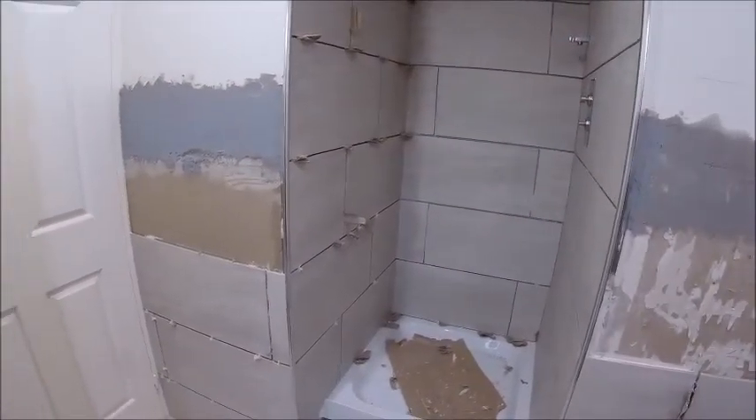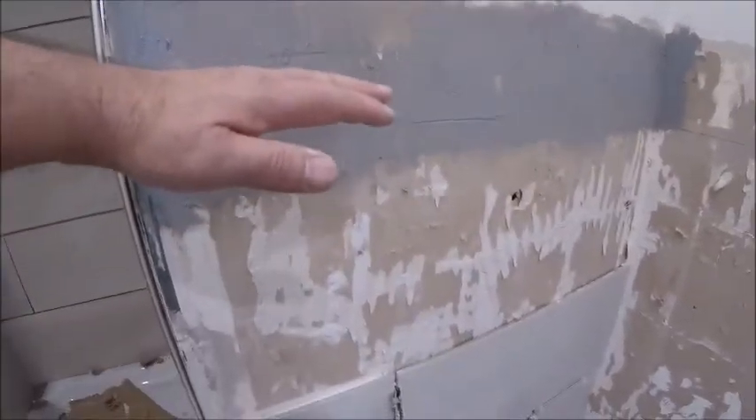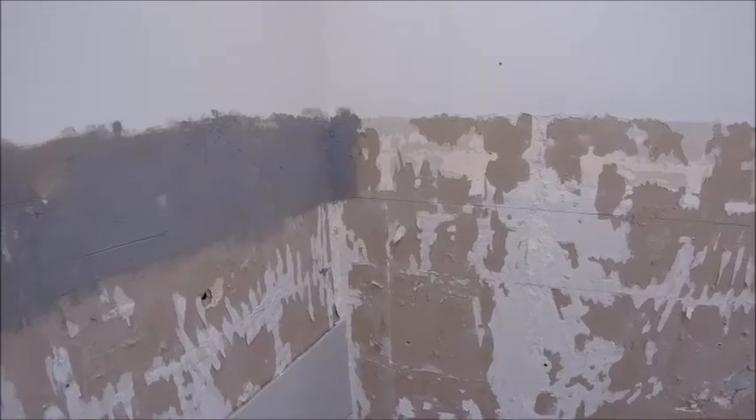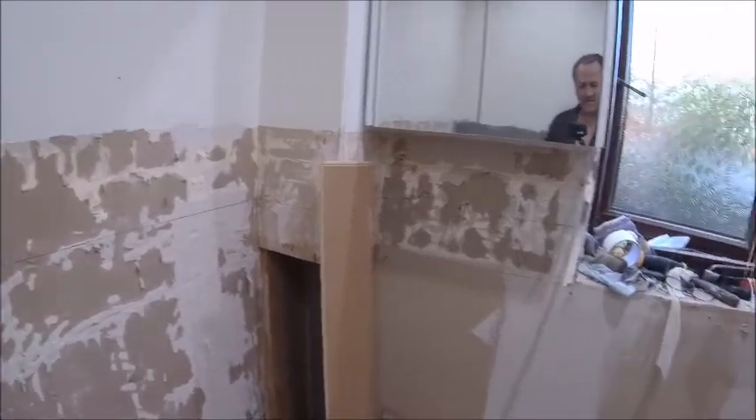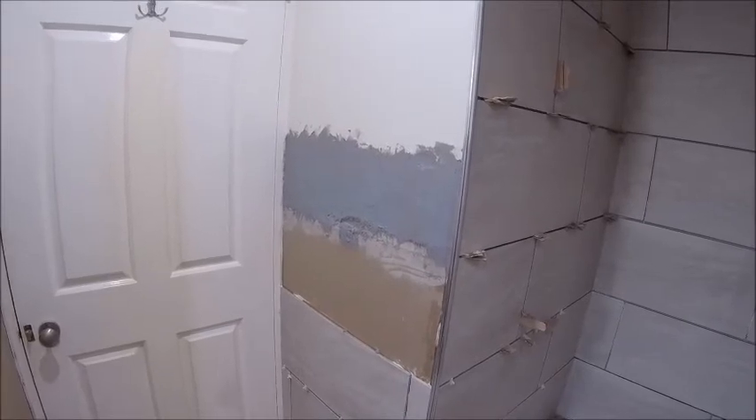It's been a long old day - about six o'clock at night. I've got the first three rows on that side and the same on that side. I finished the shower earlier and just started filling up the walls. The tiles will come to about here, which is a bit lower than before but that's fine - going any higher would look silly. Run out of filler so Deb's gone out to get some more. It's slowly getting there. Tonight I want to rub those down and get some paint on, then put the last row of tiles on so I can fit the silver coping strip.